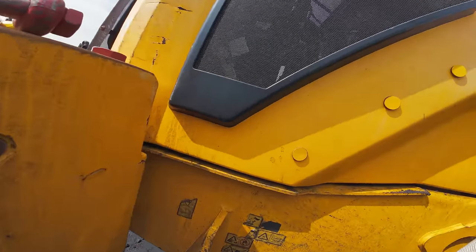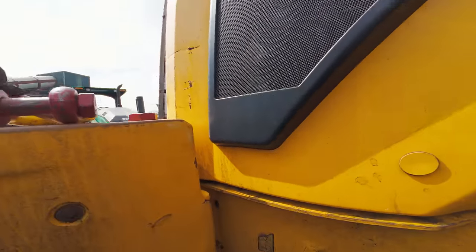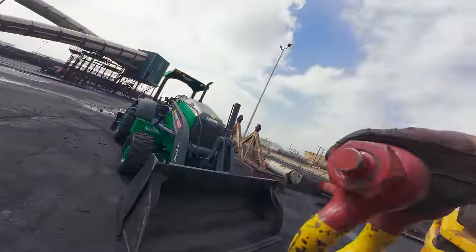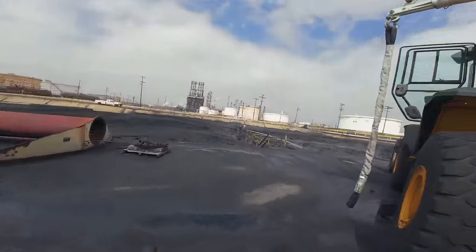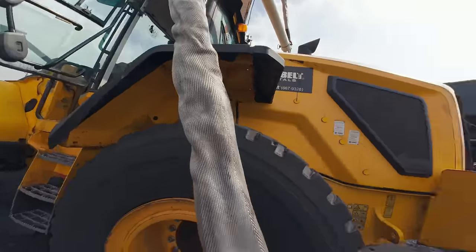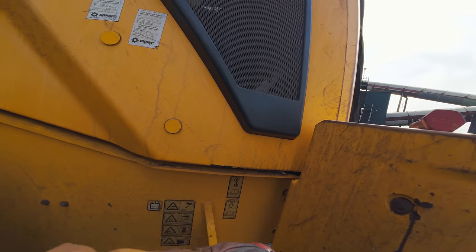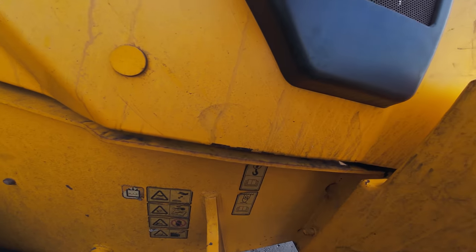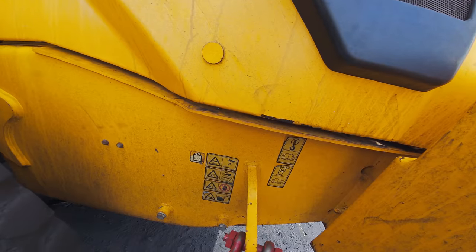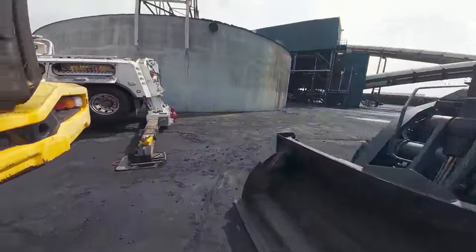Touch my rigging through here. I'm gonna show you my other videos. You see me use these Skookum shackles. They're wonderful. They have a really high working load limit, which is proprietary to Skookum, which is always nice for those heavy lifts. This one actually happens to be a 1 1/4, rated at 21 tons, so 42,000 pounds, which is nuts.